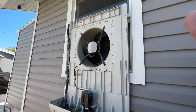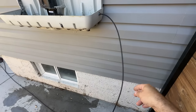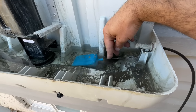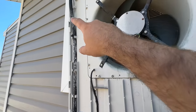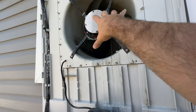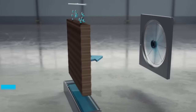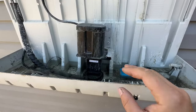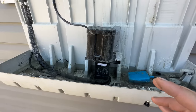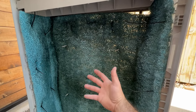This is an evaporative cooler, or what they call a swamp cooler, and it's very simple. You have a water line — typically a quarter-inch flexible line — that goes in and fills the bottom pan with water, after which a pump pushes that water up through a tube and soaks the pads on the outside. Then when the fan comes on, it sucks air through the pad, creating a cooling or evaporative effect. Any component that needs to be replaced is extremely cheap. On the inside of the pad, it is just cold to the touch — all that water is able to evaporate and have a cooling effect on the air inside.